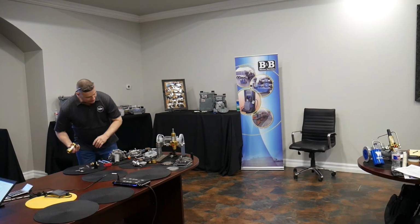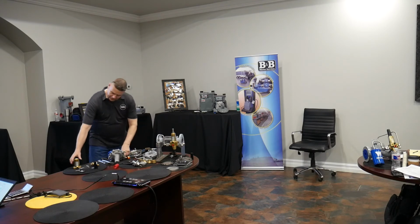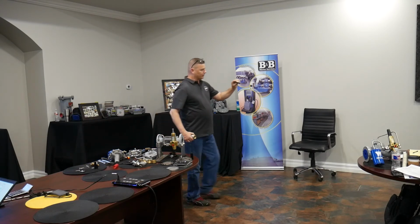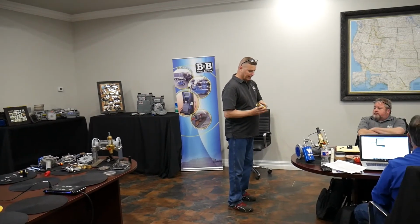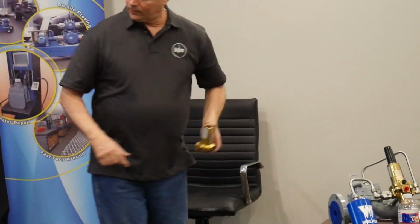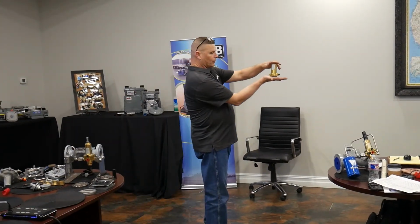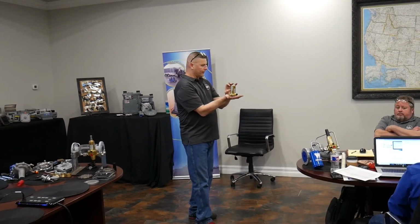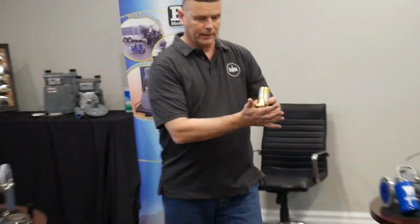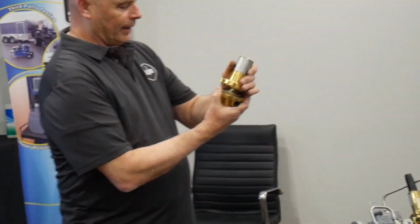we can make this same pilot, by the way, high pressure, by just simply putting a spacer right where the normal diaphragm goes. Okay, so when I do that, when I put this back on the body you guys have, I've got a little physical room that I can see. The bolts are long enough where it'll still snap in. I get my 8 foot-pounds. Thank you. So it just fits down on there and I see a physical space.